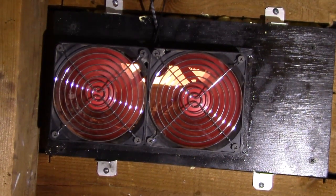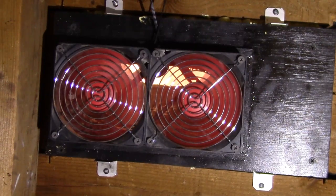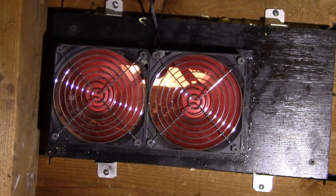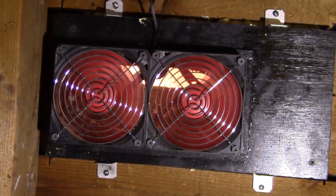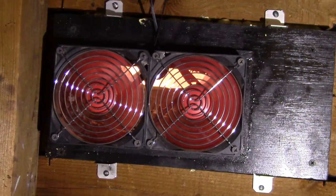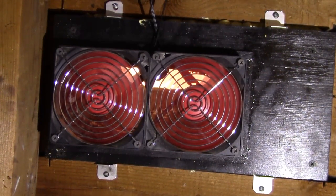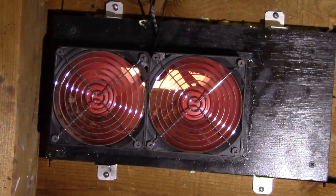In this case the solar heating part is free — sunlight hits the roof of the house and heats the air below — but I didn't want the moving the hot air part to be an ongoing expense. So that's where solar power comes in, using the sun to produce electrical energy to power the fans to move the air out of the attic.